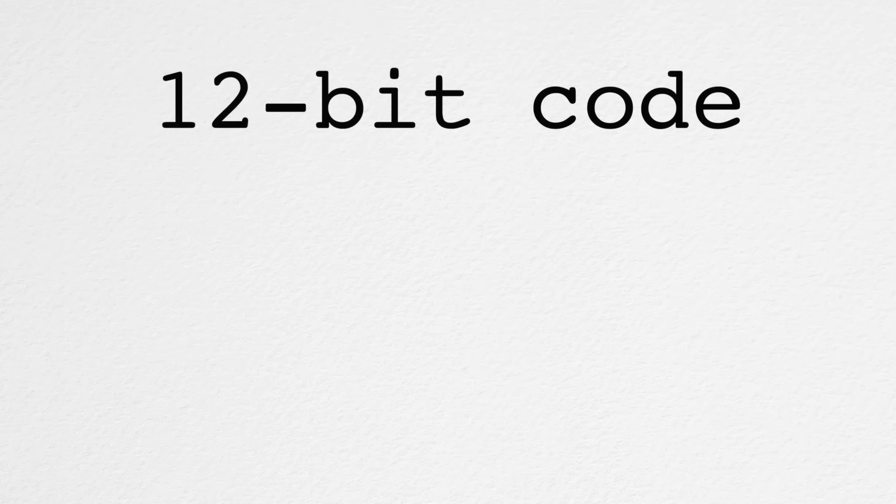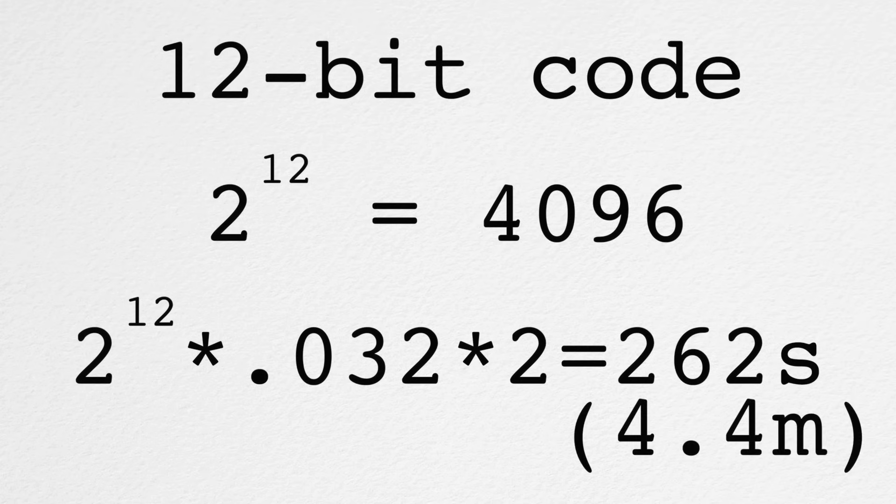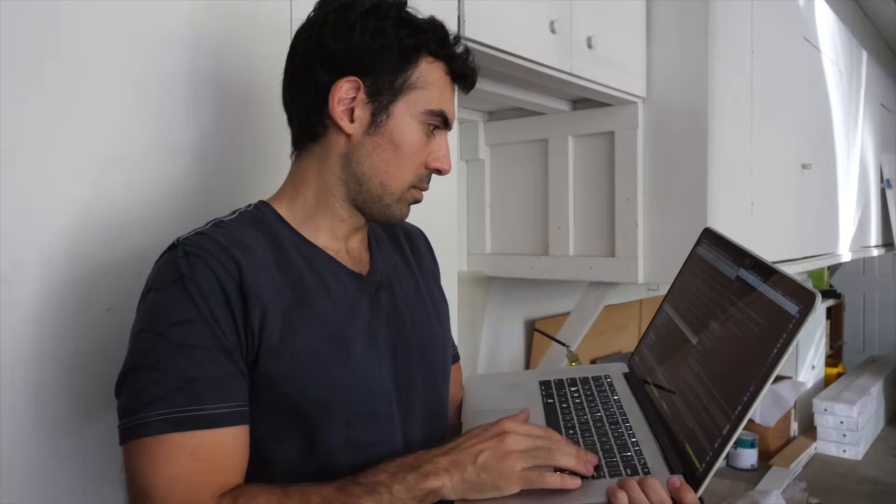If you used a 12-bit code, that would give you 4,096 different codes that you would have to try. And adding in gaps between each code, that would take around 4 and a half minutes. But then Sammy found something interesting. He added data in the beginning and it still worked. So essentially, it's like saying if your password were A, B, C, D, and I just did X, A, B, C, D — but it still opened. In fact, let me try putting even more information up front. You're putting a whole bunch of junk up front, but I still have the right password in there, prepended with a bunch of junk. And that's funny.